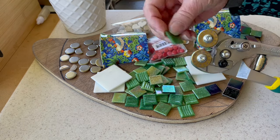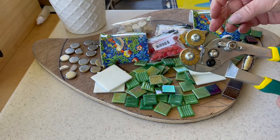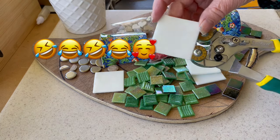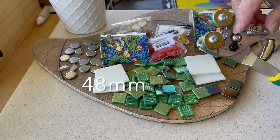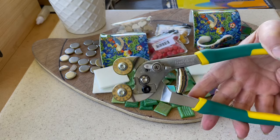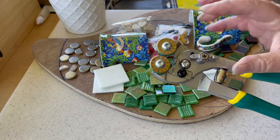Popular vitreous tiles are four millimetres thick, so you want to turn it to number one to open a little wider so it fits in. It will even handle these large vitreous tiles. For something even wider, I'd probably choose a different tool — I just don't have the strength to cut anything that wide. But that gap adjustment has always been a great feature and one of the differentiators of these wheel nippers.